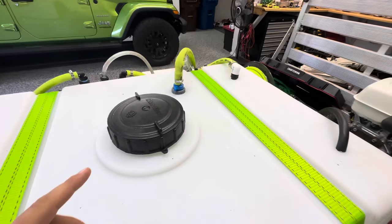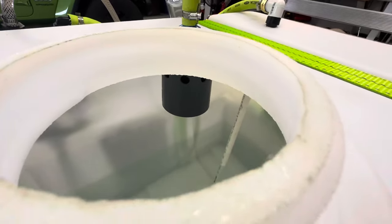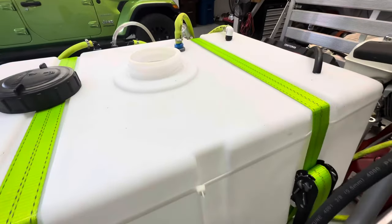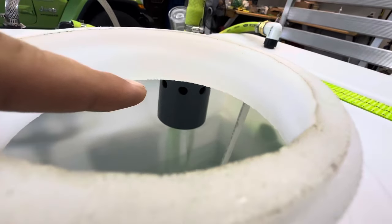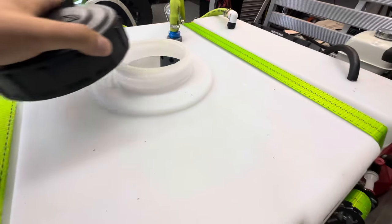The first thing you're going to want to get is a Hudson float valve. If I open this up right here, you can see it in there. What a Hudson float valve does is basically, once you're filling up your tank and the water goes up to a certain level — one of those circles right there — it cuts off the water so it doesn't overflow, which is really good.